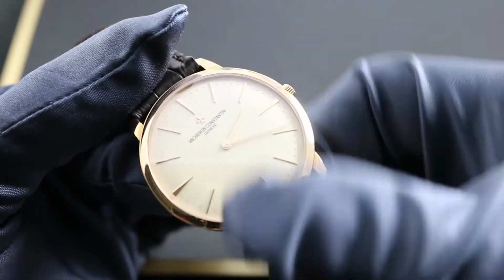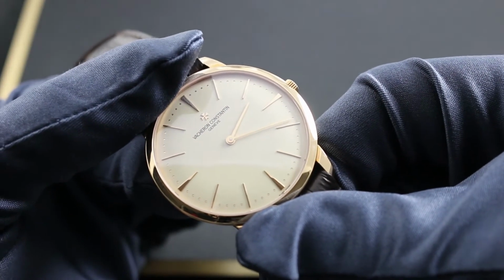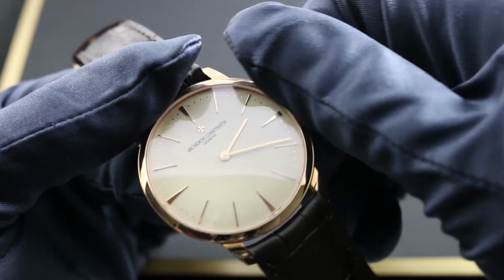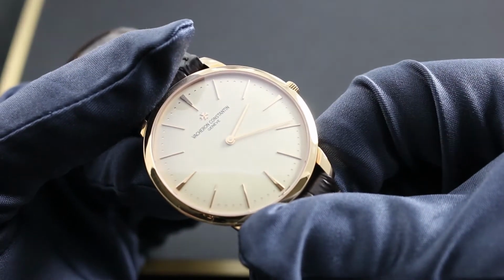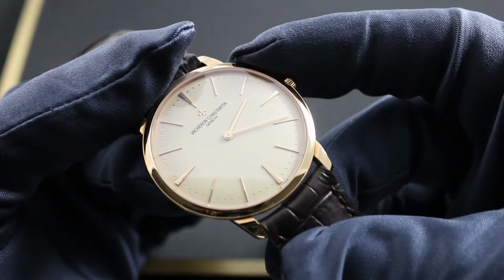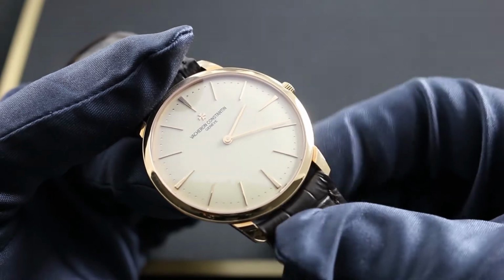At approximately 20 turns, the watch will have enough energy to begin the beat of the balance. Continue winding until light resistance is felt. At this point, the manually wound caliber will be fully energized up to its rated 40 hours of power reserve. It is important to stop at the point resistance is felt to avoid damaging the caliber.